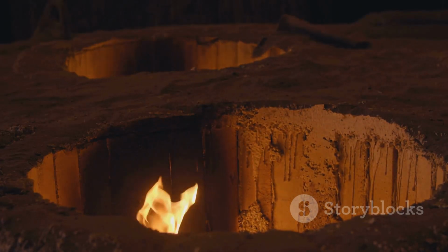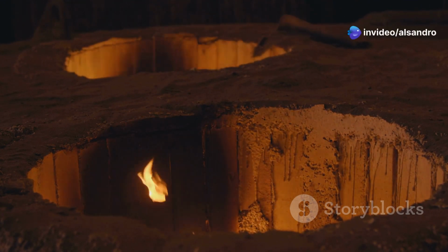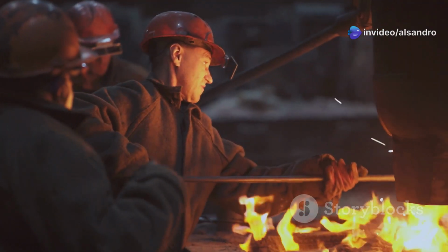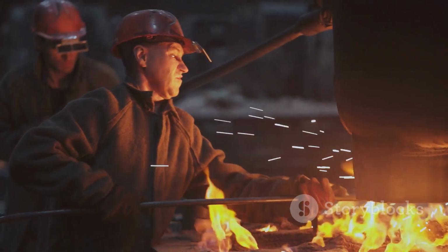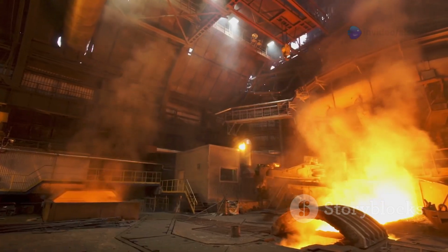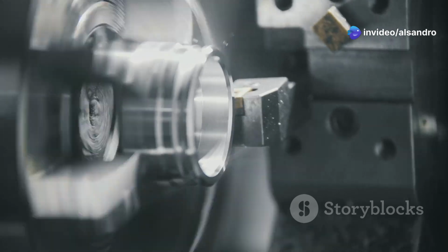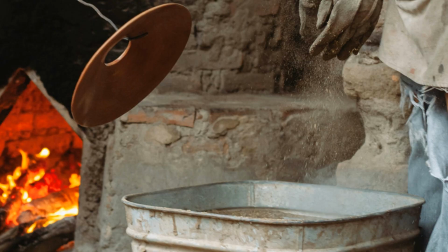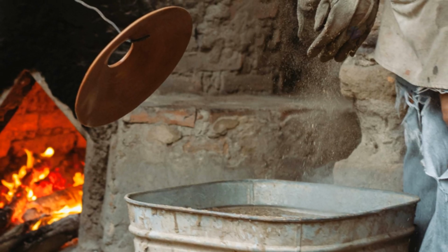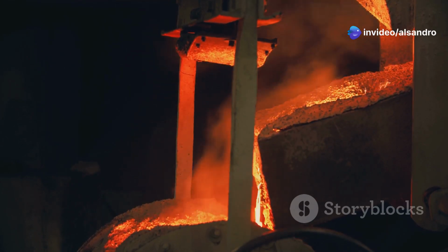Beyond the type of metal, Greensand is also adept at producing castings ranging from quite small, intricate parts up to reasonably medium-sized objects. While it might not be the first choice for, say, enormous engine blocks or massive turbine housings, those often require different specialized methods. It comfortably handles a vast spectrum of components that we encounter every day. Think about decorative hardware, small machine parts, artistic sculptures, prototypes and custom tools. The ability to produce such a range of items in various metals, all with the same fundamental molding technique, is a testament to its inherent flexibility and robustness.